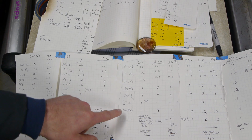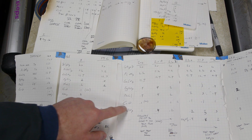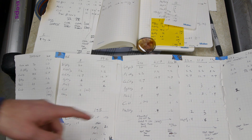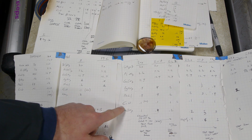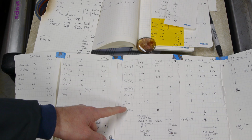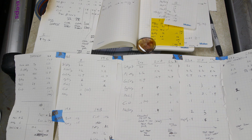I believe the copper oxide is also chosen because it works over a large temperature range. So you'll notice that with normal photochromic, even commercially made photochromic sunglasses, at very cold temperatures, they will not become clear very quickly. Like if you put it in your freezer, it may take months or weeks or something to become clear. Whereas at high temperatures, it works pretty well. And the copper oxide is responsible for reducing that temperature dependence.